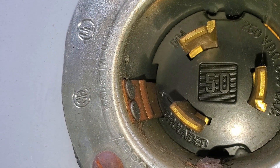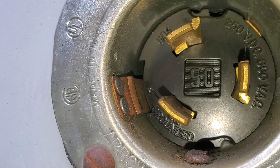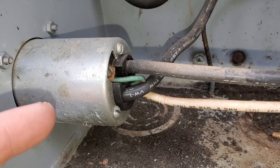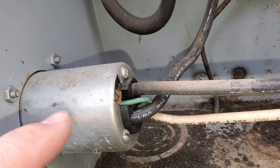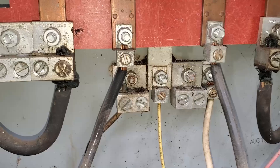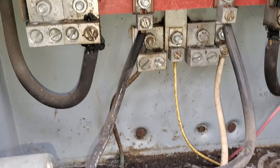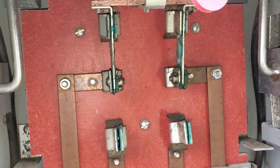You can actually see on the left there where the outside of the plug presses firmly up against that terminal connection point. Inside of here we have our ground wire, which it looks like they jumpered over to the neutral — that's not preferable. They should have just run another heavy-duty ground wire over to where the neutral is connected. And then we have our neutral wire connecting up over there, and our two hot legs are obviously what would be feeding our system.